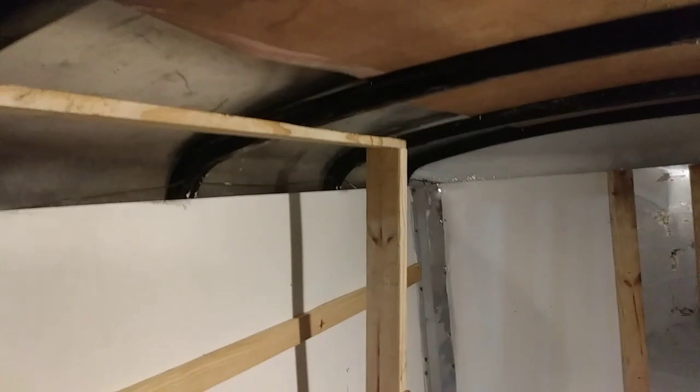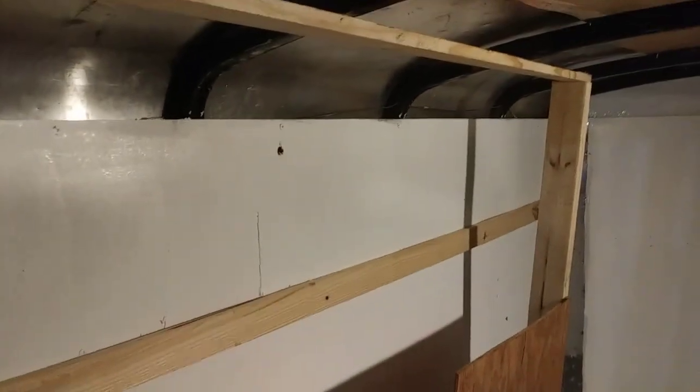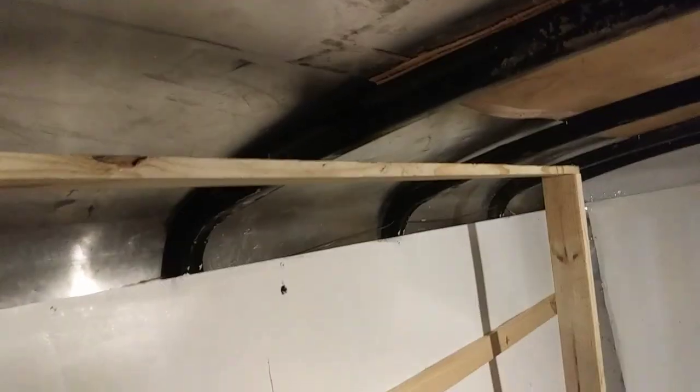So of course, like I said, I got to rip these, and then they will go into the opposite corners, and then we'll shoot our slats from side to side. Those will be 5 3/4 is what those are going to be. And the mattress will fit right on in, and then I'll hook up some type of locking system here so no one gets beamed. So yeah, it opens up our living area as long as someone's not trying to sleep.